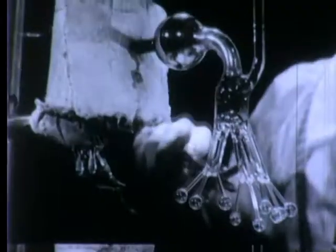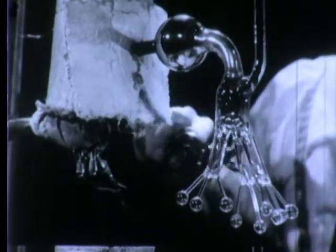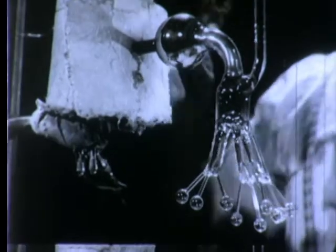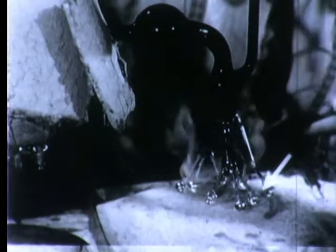Now for the third step. In this stage of the distillation, the sodium is again vaporized and passed from chamber three down into chamber four, which looks like some sort of Christmas tree ornament. Ten minutes go by. The blackening of the glass by the hot sodium is well advanced, and the melted sodium itself is being forced down into the little glass balls or pellets by argon gas under pressure.